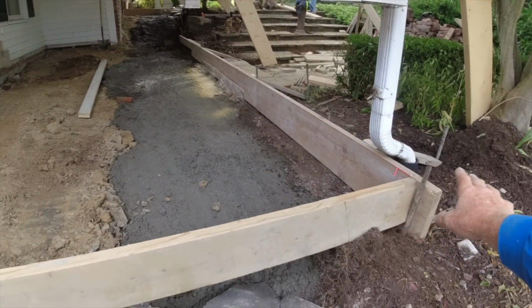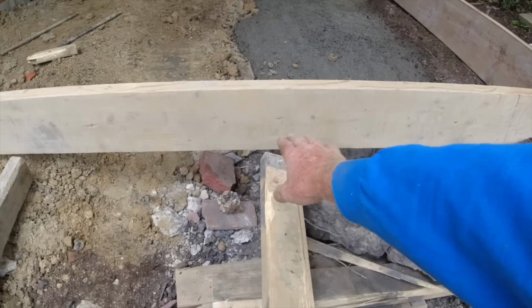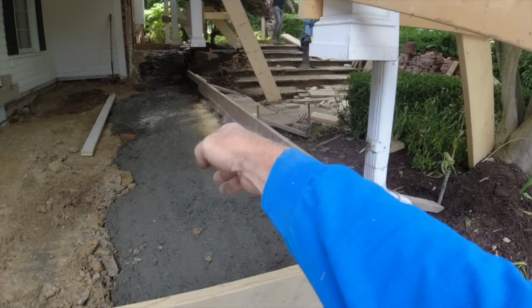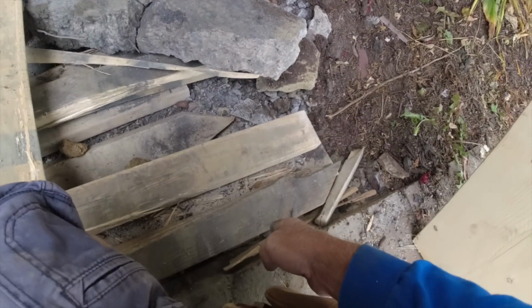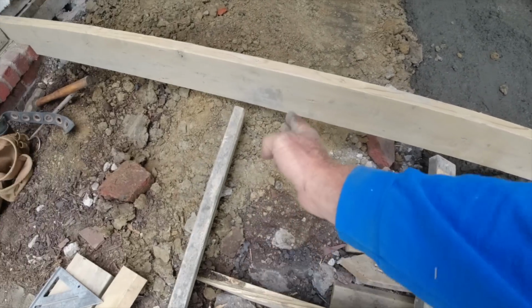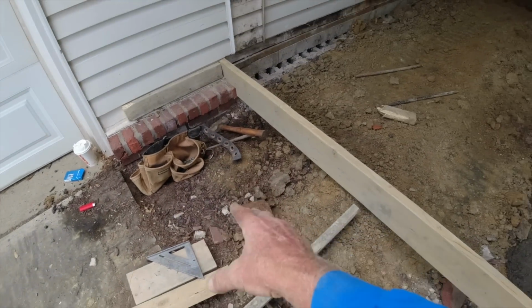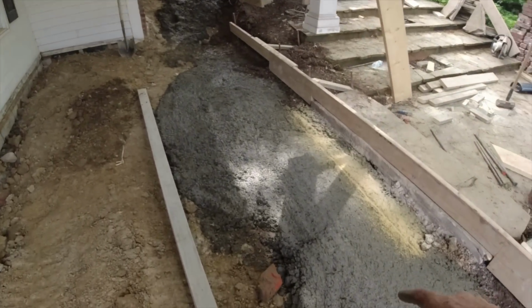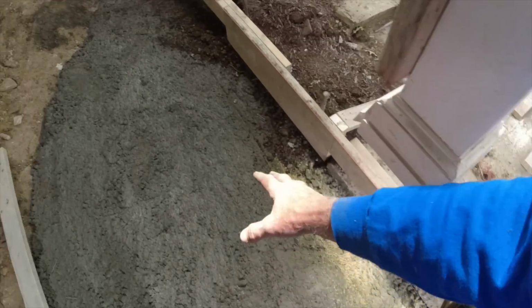It comes across. Coming over here, Ryan's working on a walkway to go 1 foot in from the post, coming straight out to the driveway. 4 foot wide, keeping a planter bed here. So over here, what we're faced with, now that the footer's getting nice and hard, we can walk on it.